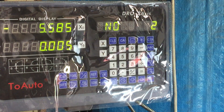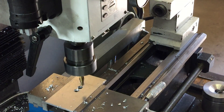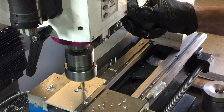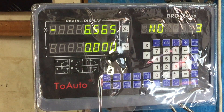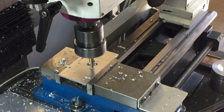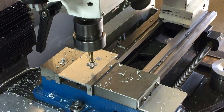I was so dreading being able to understand the technology. Down arrow for number three — move to zero on the Y axis, move to zero on the X axis, drill the hole. Here's a trick for dummies: lock the slide before you drill a hole with an end mill, because this third hole, I found out later, did not drill straight. I guess that's what testing's all about.